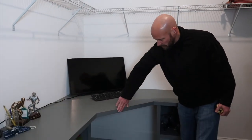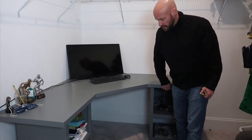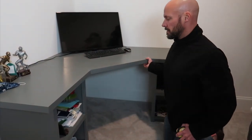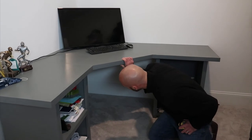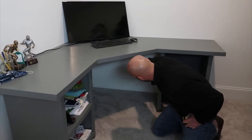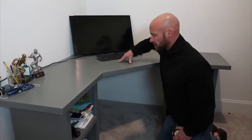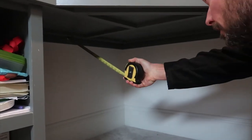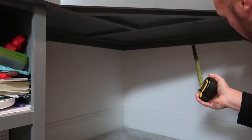I trimmed all of this out in pine, which does two things: it covers up the plywood face — there's no way paint alone makes that look good — and gives a clean finished edge. Underneath, I cut two boards to sit in the corner as braces for the back, so this desk is extremely solid. You could stand on it.